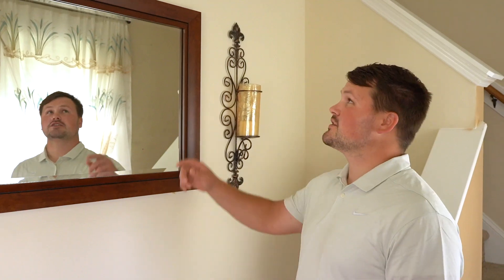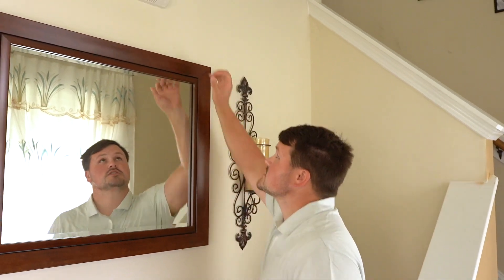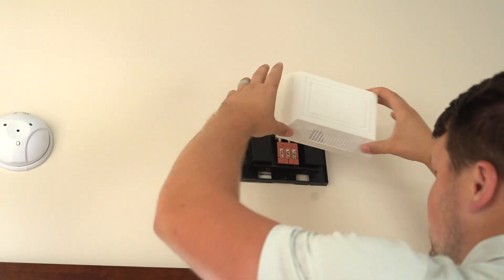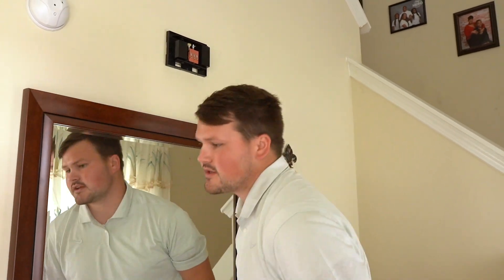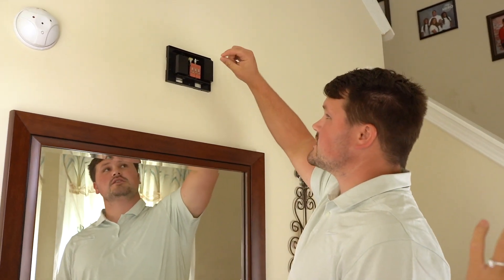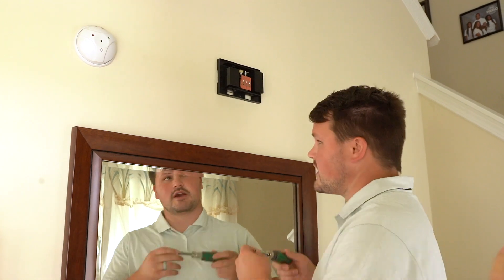The first thing I like to do is find the chime box and see if there's an outlet or a power source next to it. What I'm going to do is just pop this off and see if I can find two wires behind there. If there's two wires, then it's really easy to find the doorbell wire and run that to an outlet. So I'm going to pop this off and take a look.